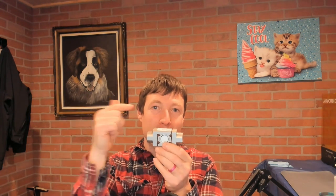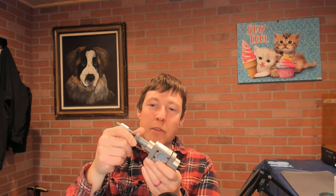One important thing to know about load cells is they really like to go in the direction they're designed for. This one is in tensile, which means it doesn't like getting squished the other direction, and it also doesn't like torque. I welded these little quick links onto these M16 bolts. When screwing them in, you do not want to crank all the way down — just thread it all the way in and then back it off a little so it's loose. Don't induce torque into it. If you need to tighten it for any reason, there are flats on here so you can do it that way.